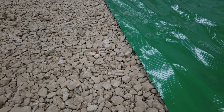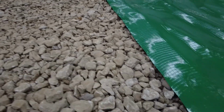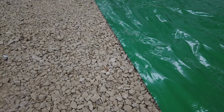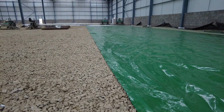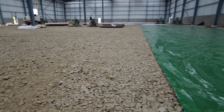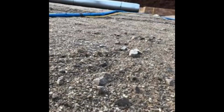The guys have welded the panels off on the other previous slabs, but that subgrade doesn't comply with your method statement. I've got serious concerns about the working method that's going to take place here. We can see a laser screed on site ready to work. The minute that touches that, it's going to go straight through it. That didn't look too clever, and unfortunately it's a common scenario.